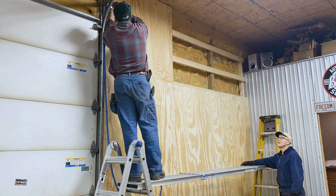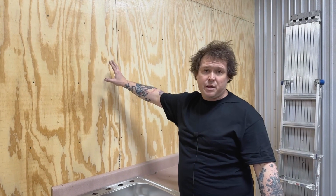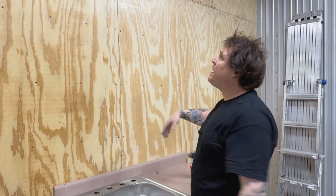And then we took and polyurethaned it. So we used some floor polyurethane actually, because you don't have to sand it. Because, well, I like the natural look of the wood, and give it a year or two and I might not like it anymore. We can just paint back over it.